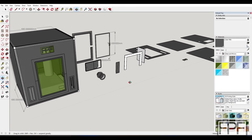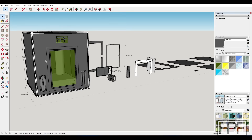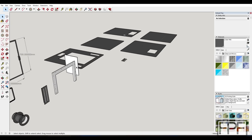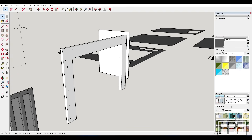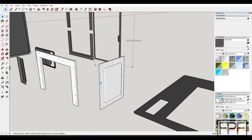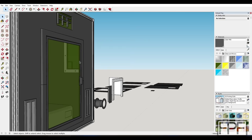Most of the additional pieces I designed are actually to help with the assembly process itself. For example, the door here on the front has an upper portion, lower portion, and inner frame that has to get attached somehow. We don't want to attach it from the front — that would leave exposed fasteners. You can see there are screw holes all along the back of these parts, so we need holes drilled through the front panel to pass screws through into those holes. This piece is essentially our drill guide — it goes in from the rear of the panel and we just pass the drill right through these holes, and all our holes will be in the right place. Same thing for the side window — this drill guide just pops in from the inside, positions itself because it's the exact same shape as the hole through the side panel, and we pass the drill right through.